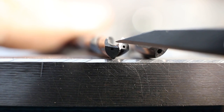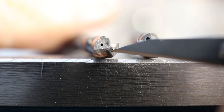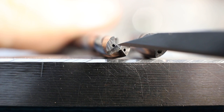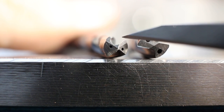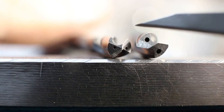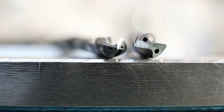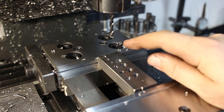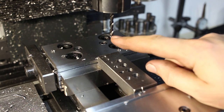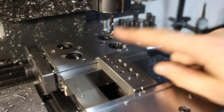So I cannot do this on the D-bit grinder. I did this on my large tool grinder. You can also do it on a surface grinder perfectly fine, or if you're brave, on a milling machine. Carbide drill, 5.5 millimeter with a thin web, done in my own shop, running at 1000 RPM, mild steel again.